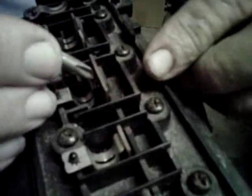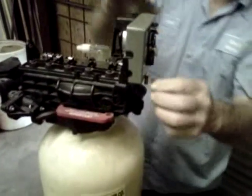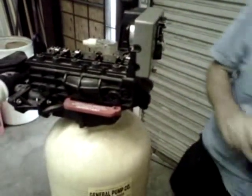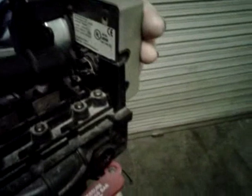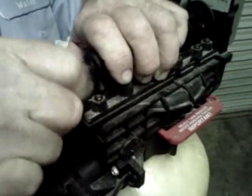Some of them have double springs — just make sure both springs go in the hole. Now we set the cam back in position. It should go first because you can break the end off of it. This little flag is just to hold it by, so it does not matter which way it's turned. This will only go in one way, so you slip it in here first. Now I'm going to move it out to the left side facing the unit so that I can pull back on the springs. When I put this in, it will guide right over that hole, get right into the hole, and everything will be right where it's supposed to be.